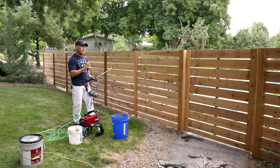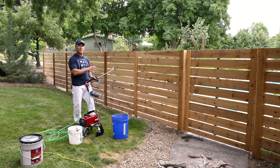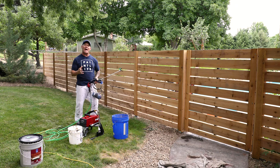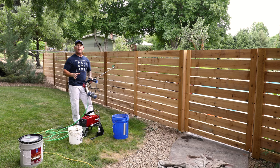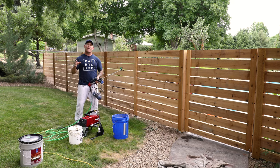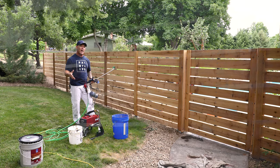The whole back brushing process is actually pushing the stain deep into the pores of the fence. This is a rough sawn cedar fence and it's going to make it last a lot longer, and you're not going to have all the striping or lap marks you typically see in a lot of fences around the neighborhoods that do-it-yourselfers spray with weed sprayers and stuff like that.